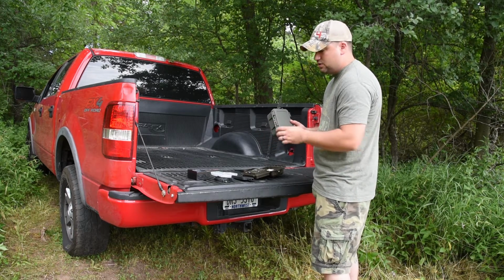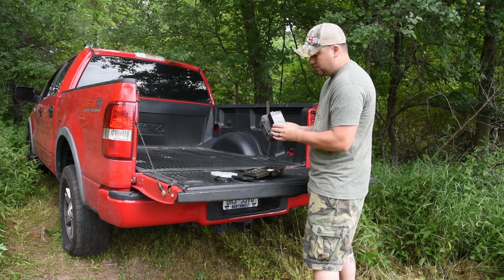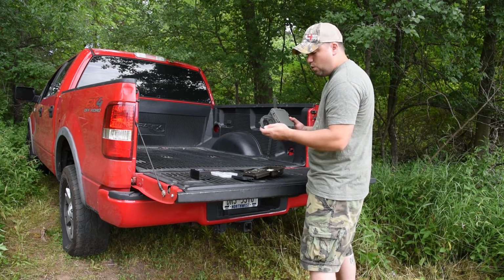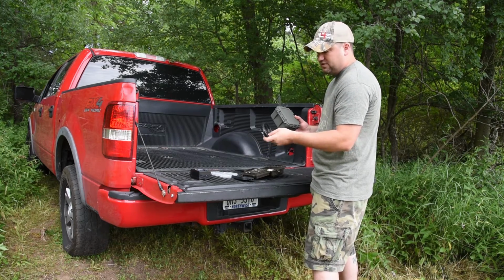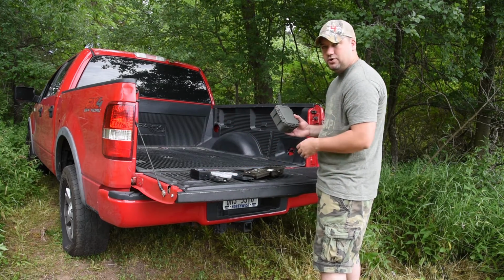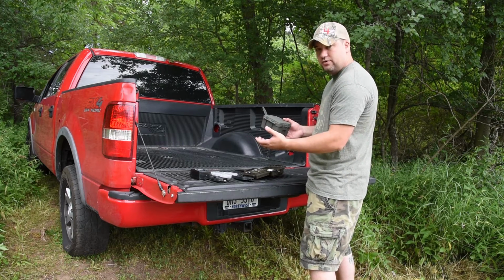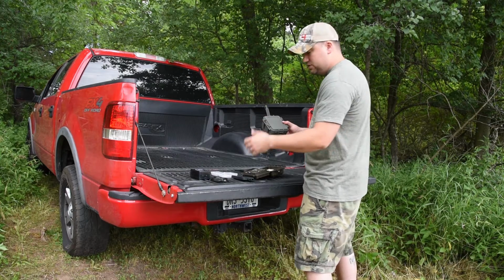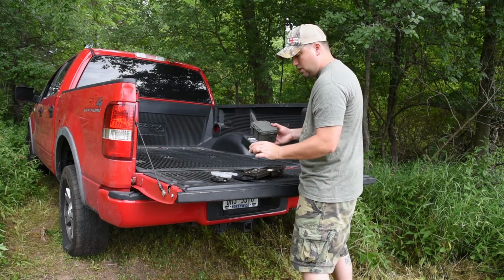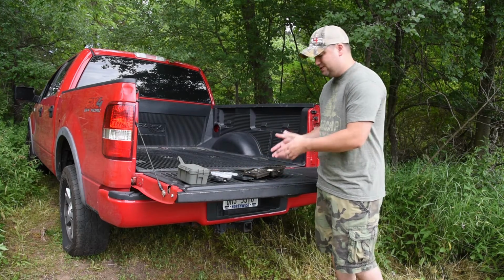For everything involved, you're really only talking about 25 or 30 bucks, especially when you add in the cost of the physical charger to charge each battery. You can buy 2 of these for about 15 bucks shipped on eBay. So you're really talking about $20 there. You can buy the cable, the SR1 cable that'll work, or you can actually make them your own. They're a basic, very common cable you can find at Radio Shack. This is about 10 bucks, and then the charger is somewhere in the neighborhood of 5 to 10 bucks depending upon where you buy it. That'll give you the opportunity to charge a battery at home, and then when you need to switch them out, you just merely go in and replace the battery, charge the other one, and you're good to go for a few more months.